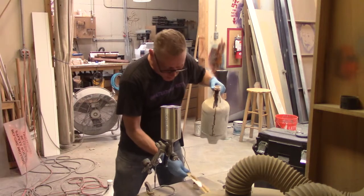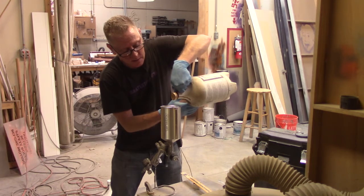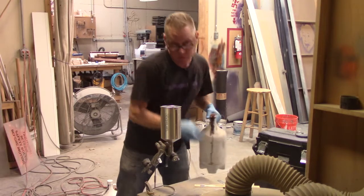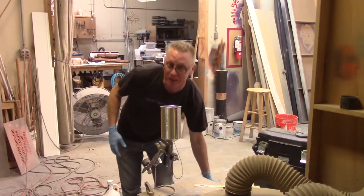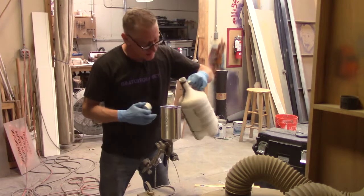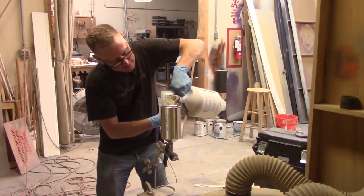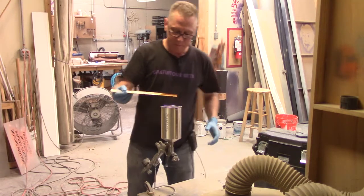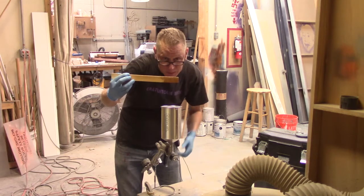All right, so this is medium dark walnut. It's got some red notes and brown notes in it. You are very limited in how much of this stuff you can add before you start making the lacquer fail. So I think your maximum is about 10%. This is raw umber. This is a pure brown note. So you can start to see that the thin part at the top is about what we're going to get out of this.